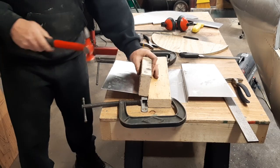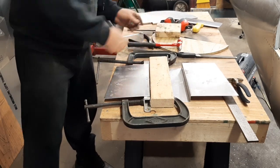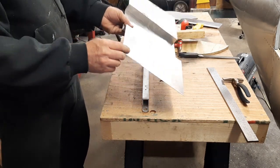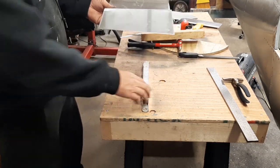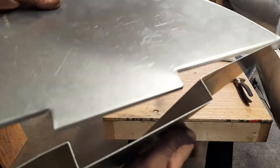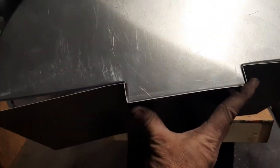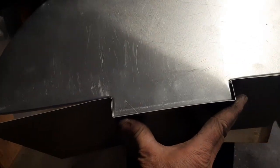Once you get it that far off, you just use a block of wood and your hammer and finish it off. Now you've got the drop center for the tank. We need to fold these edges up a quarter inch, like we flanged everything else — that'll be easy because we can mark it and do it on the big brake. The side flaps are on, edges bent up, and now it slides together. We can rivet this in a few places and then all of the seams will be TIG welded.